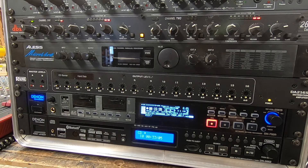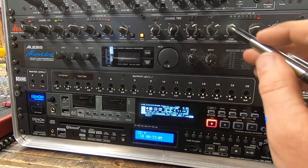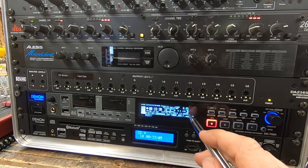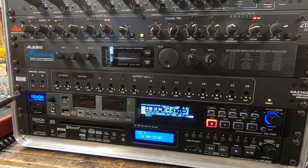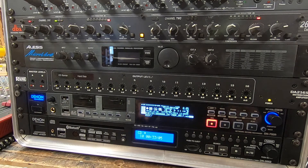Let's not overlook this simple option. Anytime I install a digital recorder, I'm going to have a compressor — analog or digital — compressing the audio input to the digital recorder. This will help limit distortion and give me a nice, tight, compressed sound. Most recorders are going to have a headphone jack — this is a quarter-inch stereo headphone jack with a volume control. You can use a stereo cable plugged into this jack and feed the input of your camera or computer, and with this volume control, you can help adjust the audio input to those devices.